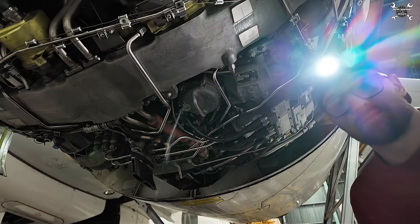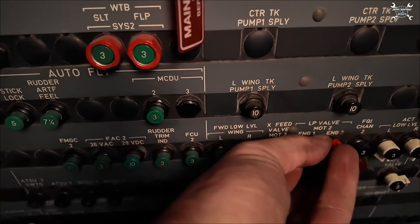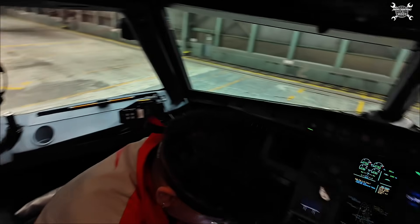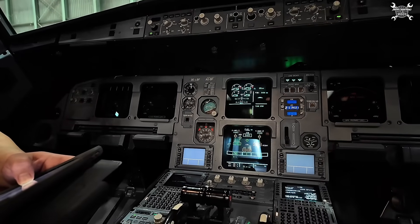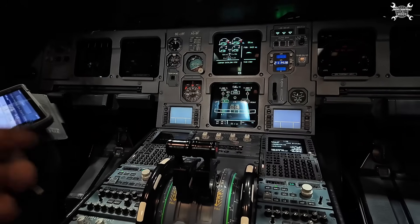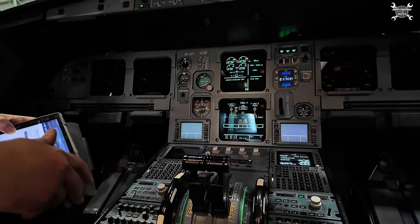Whenever fuel is draining, we can prepare the cockpit for the test. The system should be pressurized with no flow now. You pull one CB at a time — they're for different motors — and you are checking that the valve opens with each of the two different motors.